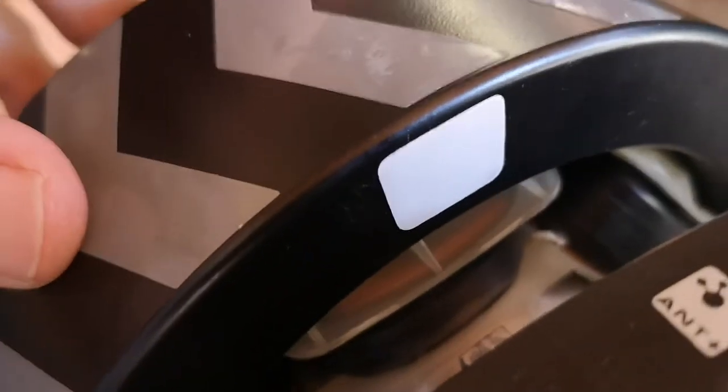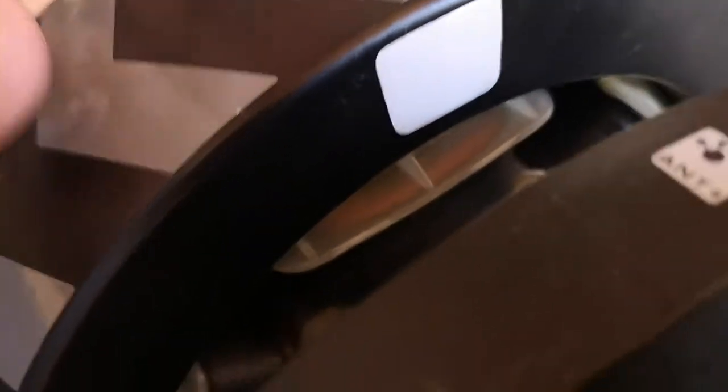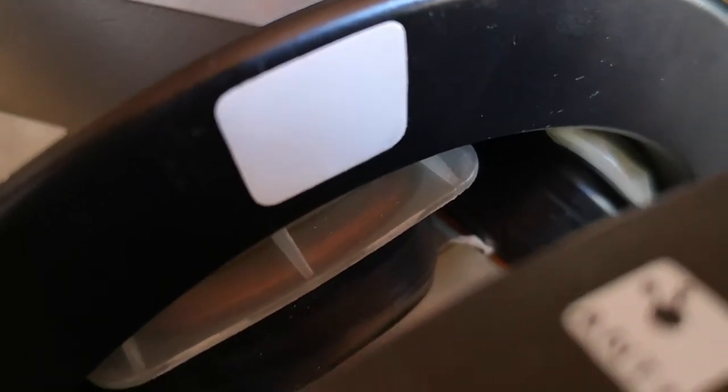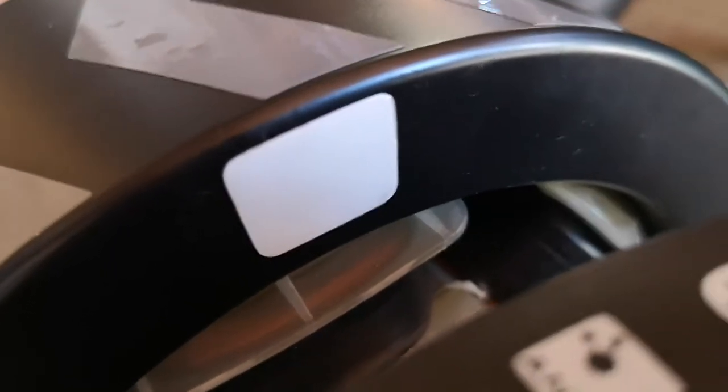The position is quite important. The broad side must be above and the smaller side at the bottom, because the sensor itself also measures the time or the length of the sticker passing — that's quite important. It's not just about when it passes, but how long it takes to pass. I think it uses that to detect the speed.